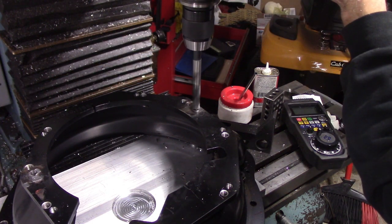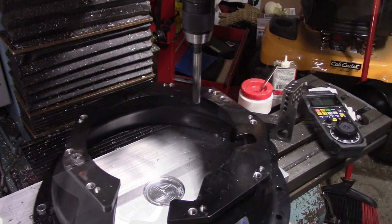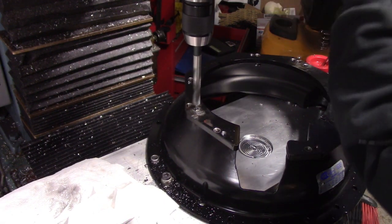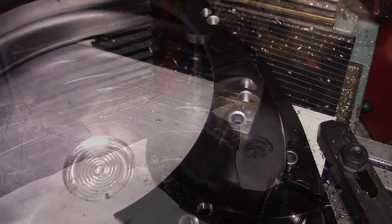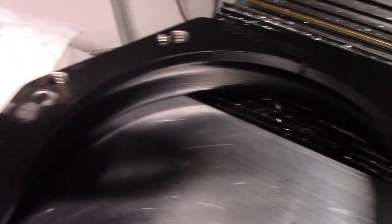This is kind of a hack, but I'm simply using a big drill bit to put a little chamfer on the dowel pin holes. I didn't have a sharp chamfer tool, so this worked okay, even though the holes have been moved. The dowel pins are moved.